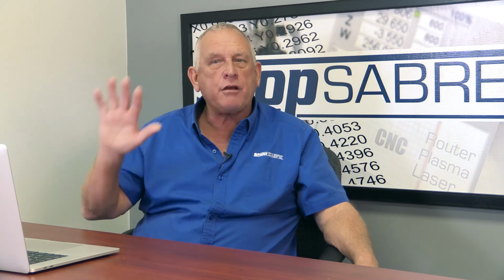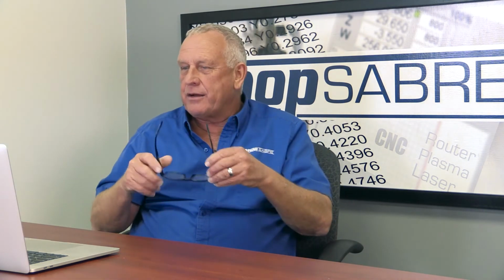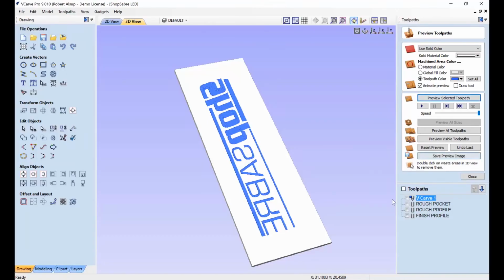Now you might say, why is that mirror imaged? Well, think about how you view this in the LED sign. It's machined in from the back of the panel, so if you don't mirror it, it's backwards. So that's why that's set up. Okay, so that's that first operation, and we cut about 25 thousandths deep with that. Then the next thing I wanted to do is to rough some stuff out because there's a little scrap here, and I didn't really want those scrap pieces to become projectiles when they're cut out, so I just turned them into chips. So that's what that operation did.